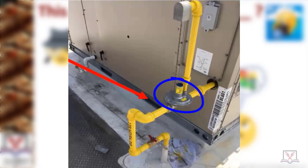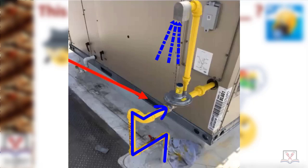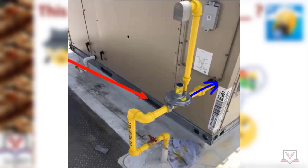The regulator has a diaphragm in there — that's why there's a rubber diaphragm under there. It's feeling atmospheric pressure from this vent: 14.7 psi on the top side of the diaphragm, and underneath on the lower side, you can see it's 2 psi. So I have 2 psi coming in, and atmospheric pressure is helping me adjust, because on the outlet side of that regulator I should have no more than half psi — very good — half psi, or 14 inch water column.